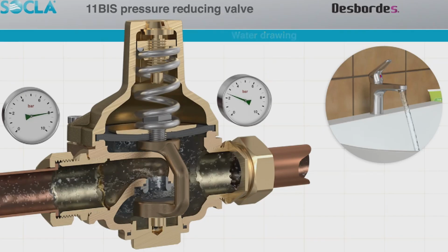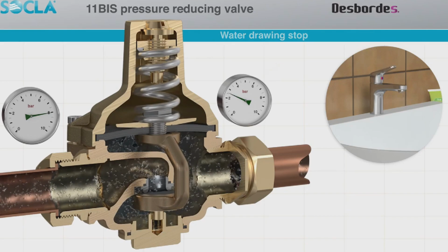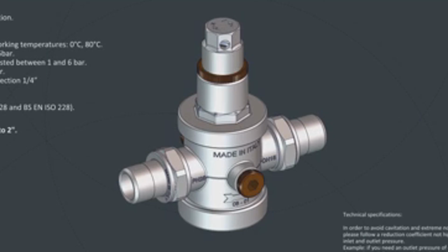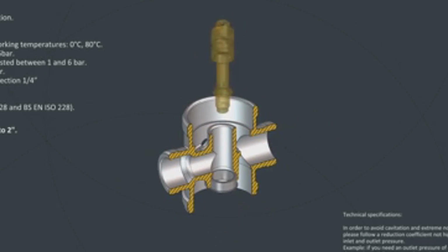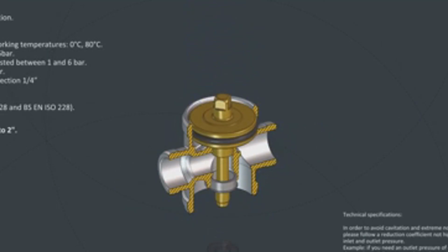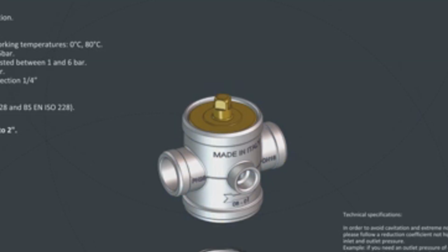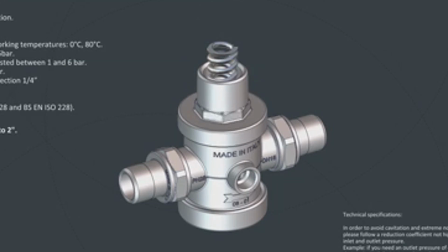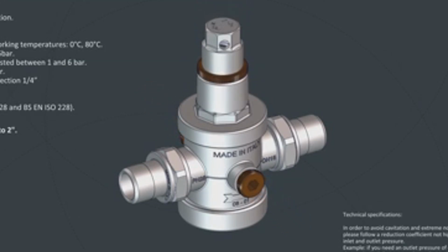Friction force and contamination of the piston or membrane. In this connection, the difference between set pressure and the actual pressure is created. In membrane PRVs, this problem is not so strong due to the absence of rubbing parts, since the change in pressure is taken only by membrane. But pistons can be really troublesome. Therefore, if the PRV error exceeds 10%, the valve must be changed or cleaned, if it's possible.